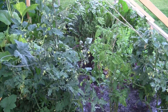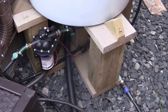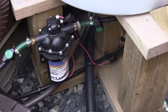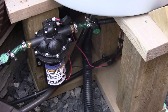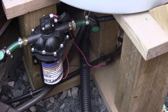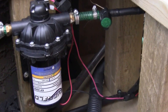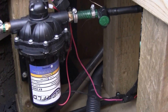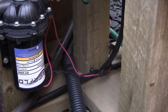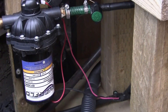Let's go see where the water for this is coming from. Here's my 12 volt pump. I've got a couple of valves on there so I can shut off the flow of water even when the pumps aren't running, because the rain barrels are on higher ground than the garden and it will siphon out and drain the rain barrels over time if I don't. I have a valve that I turn off when not using it, and a switch in the background to turn the power on and off from my 12 volt solar powered battery grid.